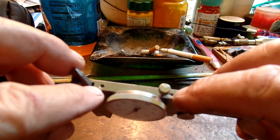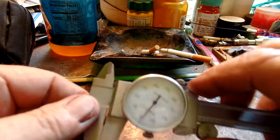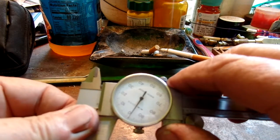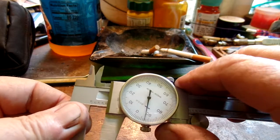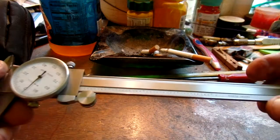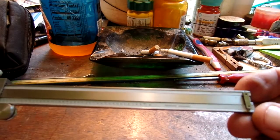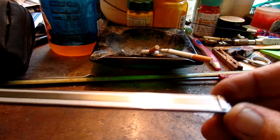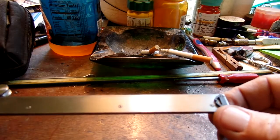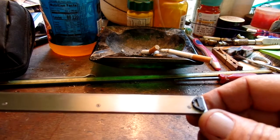It did require a little lubrication and some adjustments of these little tiny screws right here. You screw it up firm until the dial won't move, then back it off about an eighth of a turn, and that really satisfied all my problems with it. This thing is $25 and some change — it's Chinese.